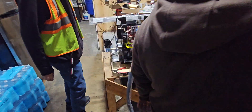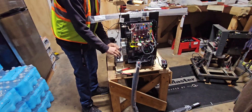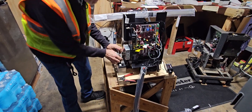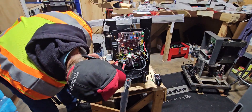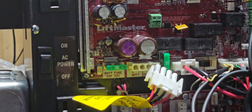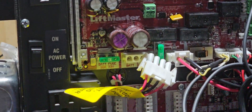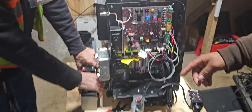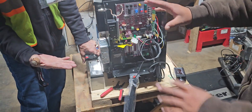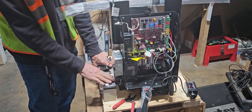Depower before you touch anything. Because if you don't and you spark the battery — see those silver fuses right there? They'll burn — either burn in two or turn black. And if I see that, I know what happened: you shorted the battery. So since the house has power ready, check that when you do it. You can hook your power up first, then hook up the batteries.